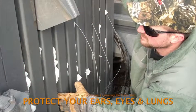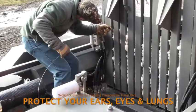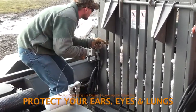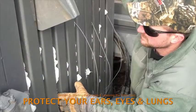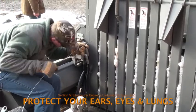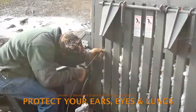While we're on the topic of personal protection equipment, we'll point out that safety glasses are also strongly recommended, particularly when working with wires that tie the finished bale. Eyeglasses and sunglasses don't provide sufficient protection unless they are safety rated, with lenses that fully wrap around. Keep a supply of safety glasses sufficient to outfit all helpers. Some should be for people who do not typically wear glasses, and others should be designed to fit over glasses.